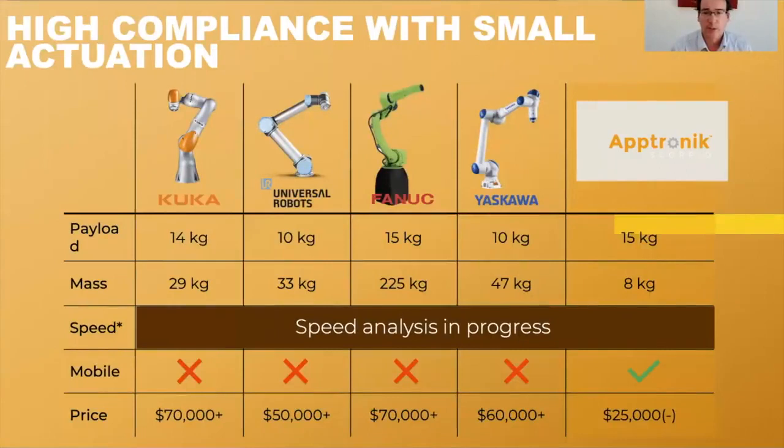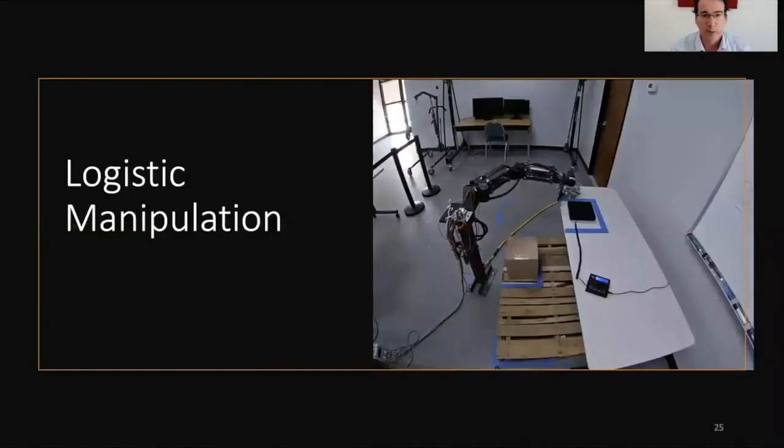Changing gears — here's one way to employ more direct drives in slender industrial arms. Because the volume is thinner, outrunner motors might not fit, except if very little power is required. So Aptronic and my lab, in a project for the Navy, explored the idea of high power-to-weight ratio actuation and designed an arm called Scorpio, which employs parallel springs to achieve this benefit. This not only saves weight but keeps the actuators really small, scaling everything down — a form of quasi-direct drive. Scorpio became extremely compliant as a result.